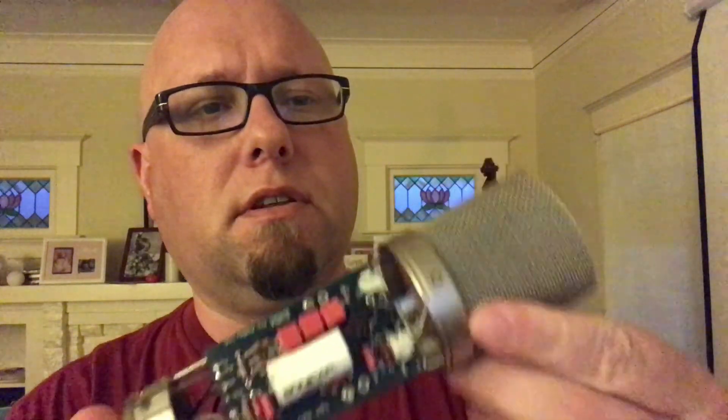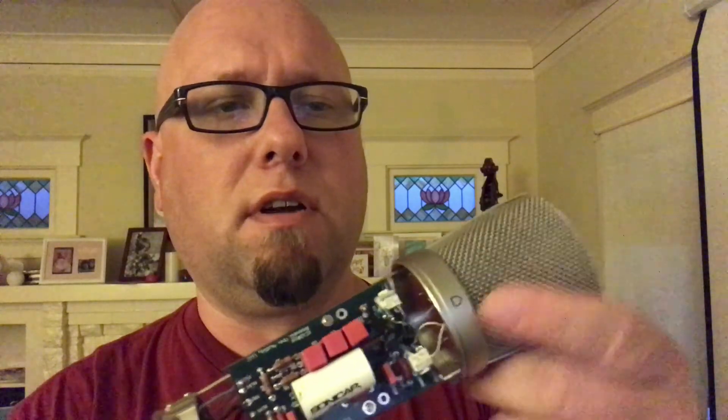So that's it. One thing I failed to mention earlier — the circuit kit for this microphone actually brings two new tricks. There are little micro switches here: one of them will turn on a 10 dB pad, the other will flip between cardioid and omni, which is what makes this such a better mic for upright bass than the unmodified microphone. Omni-directional mics up close to an upright have a much more natural sound than cardioid.